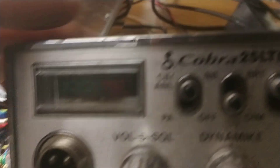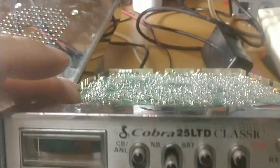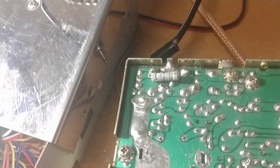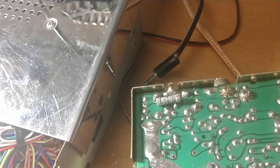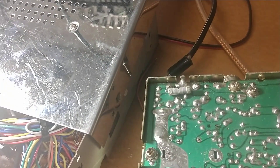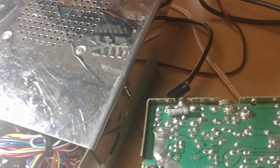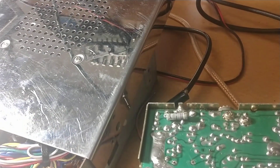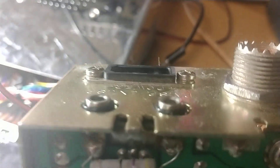Next is the easiest and the one that's been around the longest, like the 29 and the 25LTD Classic. Somebody put a talkback in this using a half-watt resistor — it'll get the job done if that's all you got, but a quarter-watt would probably be sufficient. This is a 47 ohm. You can go anywhere from 20 to probably 100 ohms depending on your speaker and your microphone. If you're running a power mic you'd probably get up in the 100 to 120 ohm range. If you're running a noise-canceling mic, probably somewhere around 40 to 60 ohms, just depending on the mic. You go from those two points right there, which is actually the PA jack and the external speaker jack.